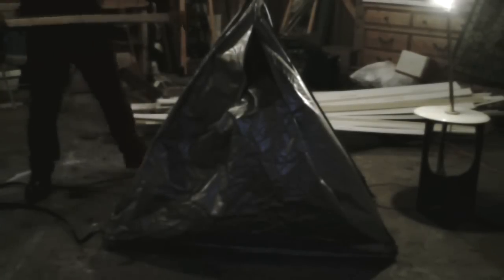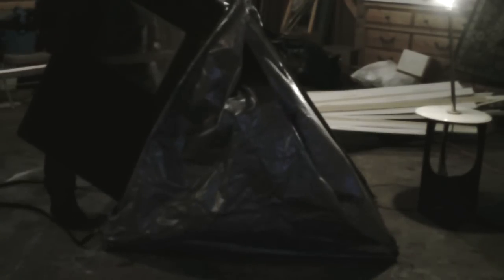Use the four foot pole, open the door up, and then just pull it out and across. How I keep the tarp on the ice house is I used just some of that cheap layered plywood, wrapped it around about this far, and shot it with a nail gun all the way around, and then just cut off the extra slack.